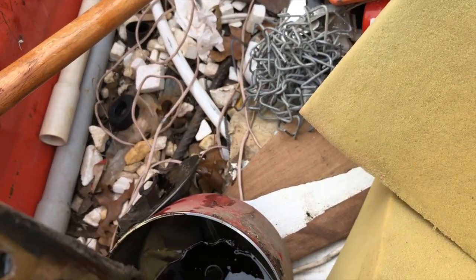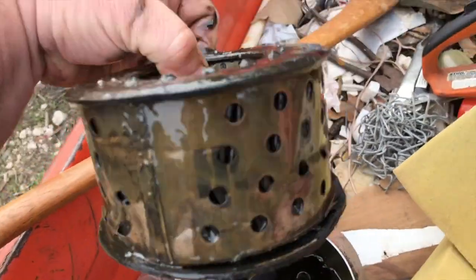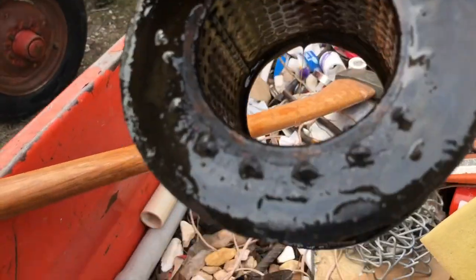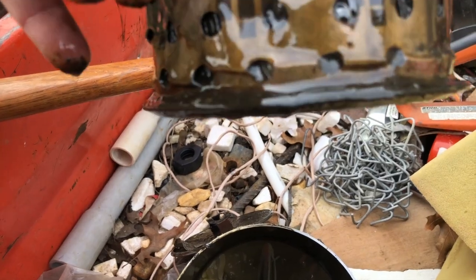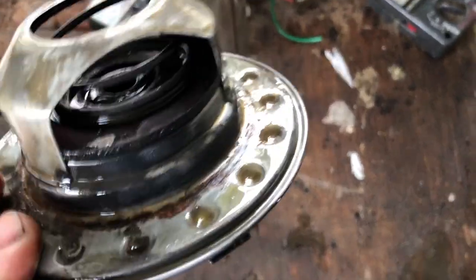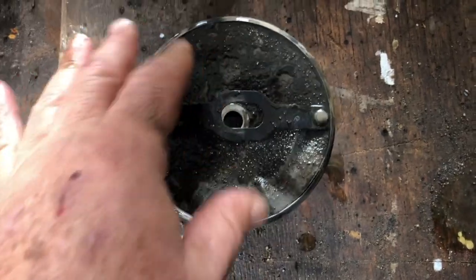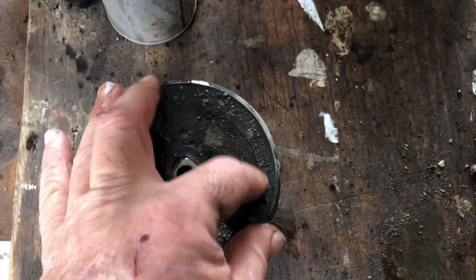This filter looks terrible and I'm almost certain it's because the pump is trying to draw through it. It's collapsed on one side — the pump is trying to draw fluid through a stopped-up filter. This is part of a little spring-loaded valve assembly. This outer part right here is a screen; it's there to catch the larger particles before fluid passes through the filter.